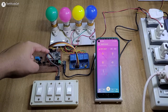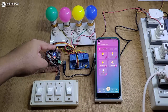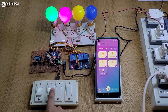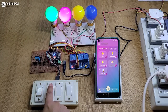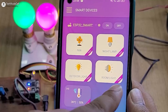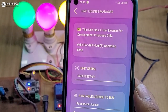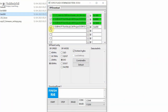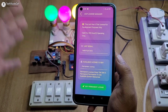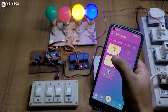Here you can see I have connected the ESP32 with the circuit. Let me turn on the supply — the ESP32 automatically connects with the Wi-Fi as the Wi-Fi LED is glowing. Now let me control the appliances with the Cadio app and can easily control all the appliances. Let me use the manual switch — we can monitor the real-time feedback on the Cadio app. I am using the free trial version, and here you can see trial is written on each device. Under the trial version, you can control the appliances up to 500 hours. After that, you have to upload the firmware again and configure the ESP32 again, then you can control the appliances for the next 500 hours. This is one major limitation of their free trial version. But if you purchase their permanent license, you can control the appliances without any limitations.